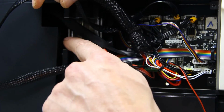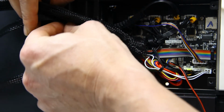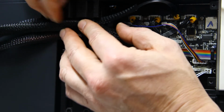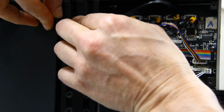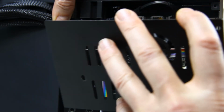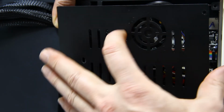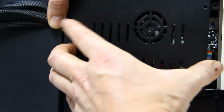Be careful of the sharp edges on the aluminium cutaway coming away from the main board. This shouldn't be a problem if everything's tucked away nicely. So just bunch it up, hold it in place, and stick the cover back on. And then it's just redoing the screws and getting that into position. Remember the longest of the 3 screws at the back, and once it's all in place, just flip it over so that you can tend to the last screw at the top of the printer.